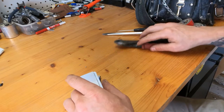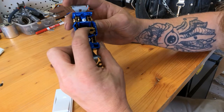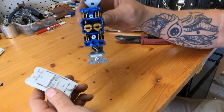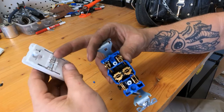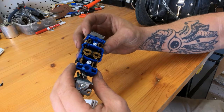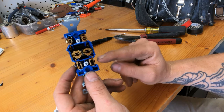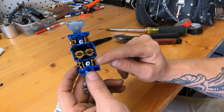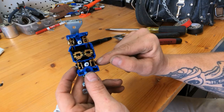There we go, now that I've mangled it. Same thing here - we've got two flappers. So this position of the switch either pushes these little plastic pieces up or down, which controls whether this goes up or goes down. This one terminal right here - let's take it for an example. Basically, if the flappers are in one position, it'll connect this terminal to this terminal.